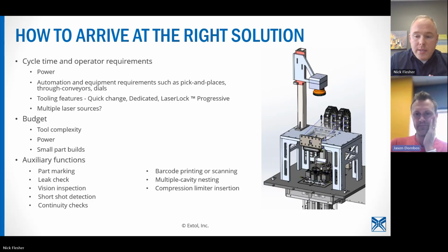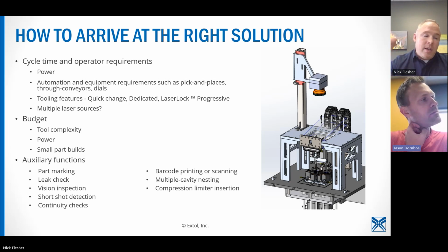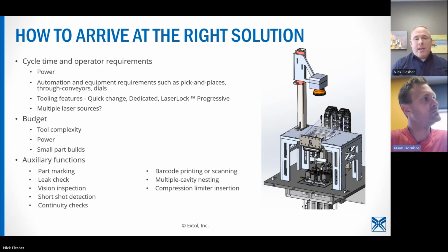Good question. Required to go to annealing oven. I would say no. I mean, I have never heard of that. I have heard of it with vibration welding to go to annealing oven. I have not seen that with laser, because you're just not putting as much heat as you are into vibration. Vibration welding is excellent if you can submit your weld to your plastic parts, not be as concerned with dust, and you've got all the material in the world to play with. Laser is not that. It's a totally different tool.